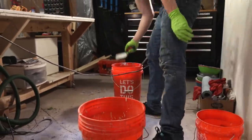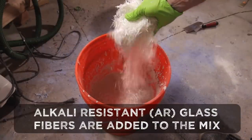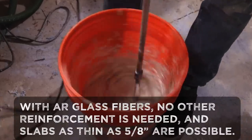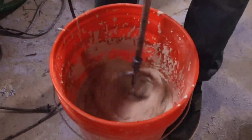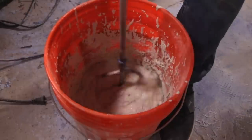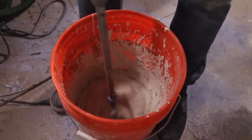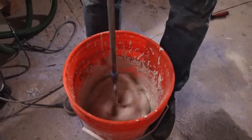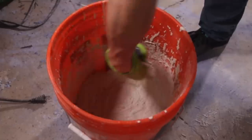If you've seen my past videos, you know I like to do a face coat — a thin layer of concrete without any fibers — before putting a back coat with fibers into the form. However, for this one I'm going to simplify it and do one batch of concrete with fibers in it. This is okay — you just want to make sure you make it a very fluid mix with a slightly lower dosage of fibers, and make sure you don't sand too aggressively when you pull the concrete out of the form because you don't want to expose the fibers.